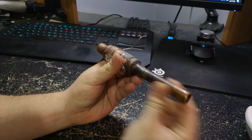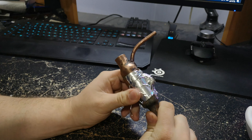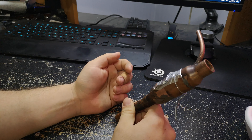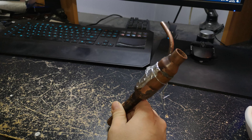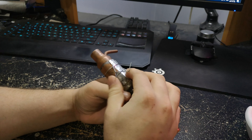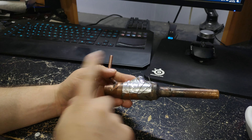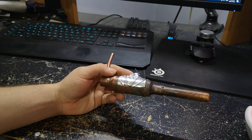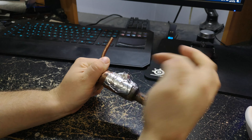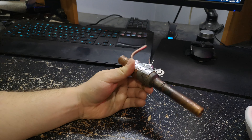Maybe I need to size this down to quarter-inch tubing for the intake and exhaust, or use a half-inch intake. I'll probably post this somewhere to get input. Copper pipe pulse jets aren't common, probably because the temperatures when running get hot enough to blow apart the brazing. I don't have a suitable welder for this. There are also designs where the chamber is capped and the fuel and intake come in at angles — I'm interested in trying one of those.